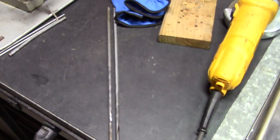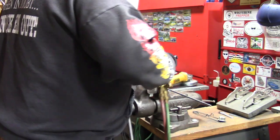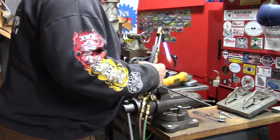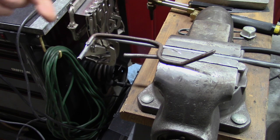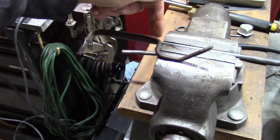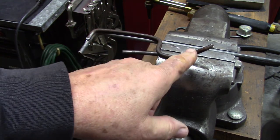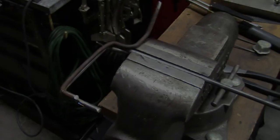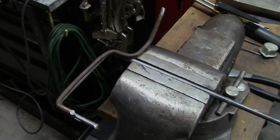I have processed the material now, so I have a couple of chances to get this right. If I do it right the first time, I'll have extra. It looks like a 90-degree bend to me. All I'm doing is just laying out the pattern. These two bends are the same as this piece, but when I get to this one I'll have to go the opposite direction — I'll show you why when we get back to the seat. Second bend complete, and I've got it set in a vise, using that as my measurement to bend it back that way.